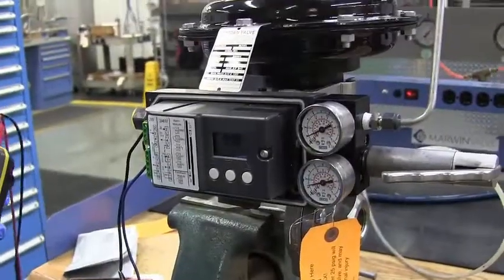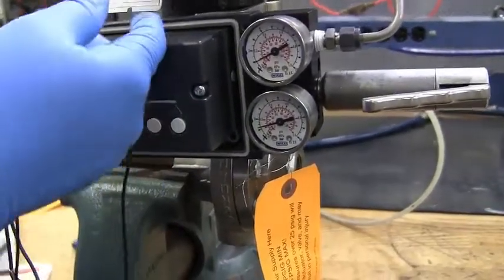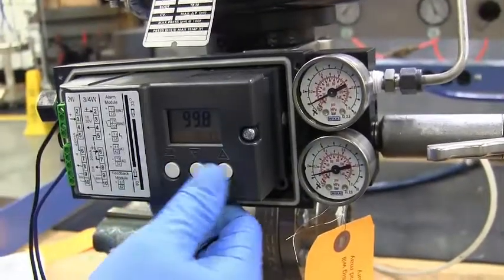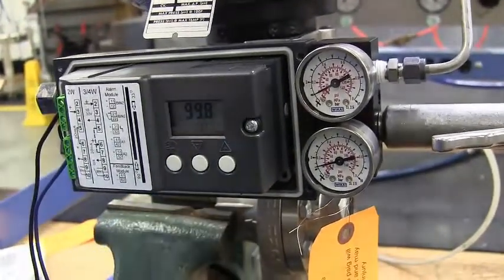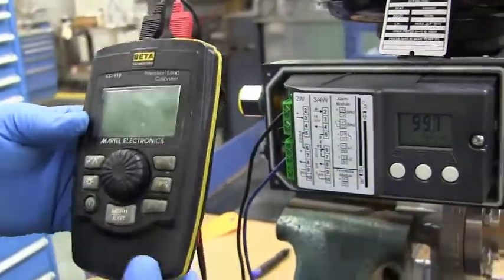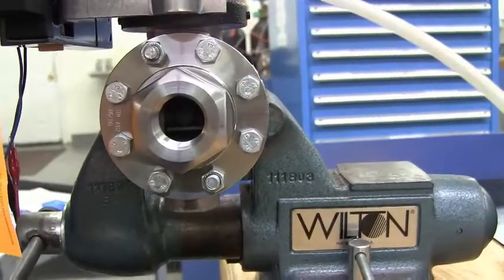That's pretty much a basic setup for the valve. Being that it is reverse, you're going to be closed and you're going to open. I'm just going to open the valve up one more time — close it. Valve's closed. Normal close to open at 20 milliamps. Hold the hand key.